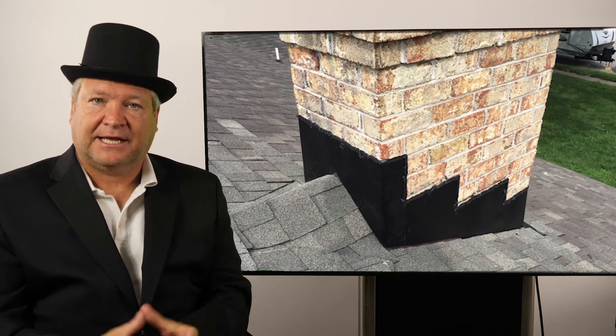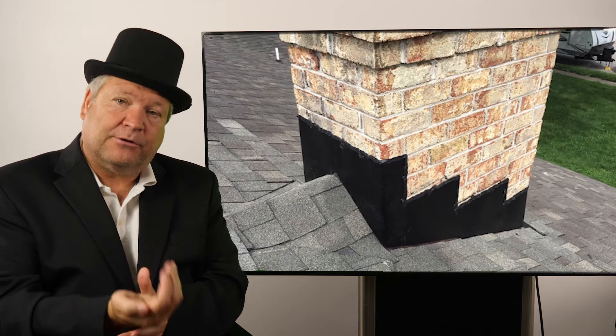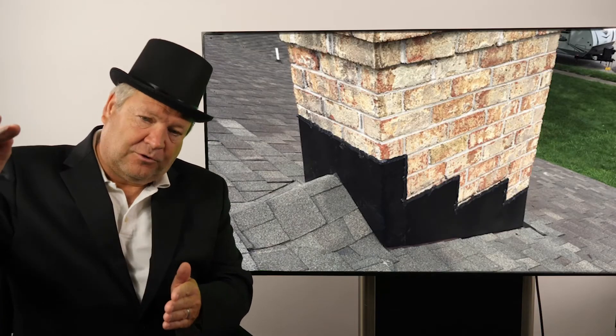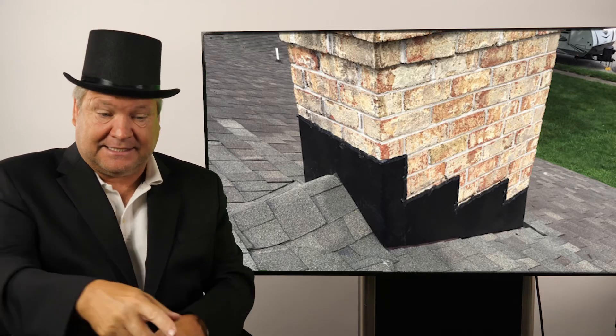What they'll do is install metal flashing. There are two parts of a flashing system: the step flashing and the counter flashing. The step flashing is basically the underlayment, or under flashing. It hits the roof portion and goes up the chimney a little bit. It also interweaves with the roof shingles so that water coming down hits the flashing and doesn't get inside that area.